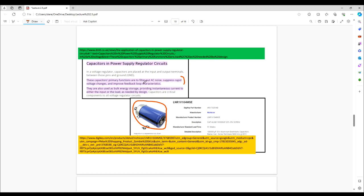Capacitors' primary functions are to filter out AC noise — we'll get to that later — suppress rapid changes in voltage, and be used as bulk energy storage. This is why they're so important to power supplies of audio equipment: the noise filtration, yes, and providing instantaneous current to the load. That's what we need when we're driving 4 and 8 ohm loudspeakers — those are very demanding loads requiring high amperages.